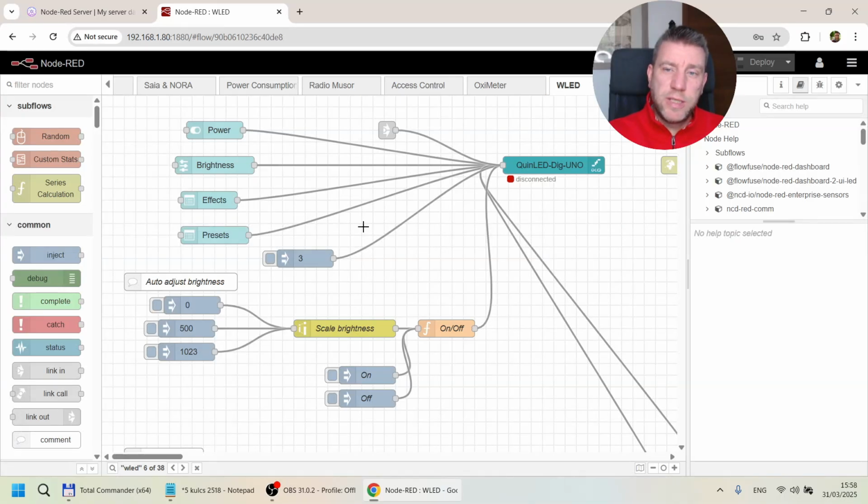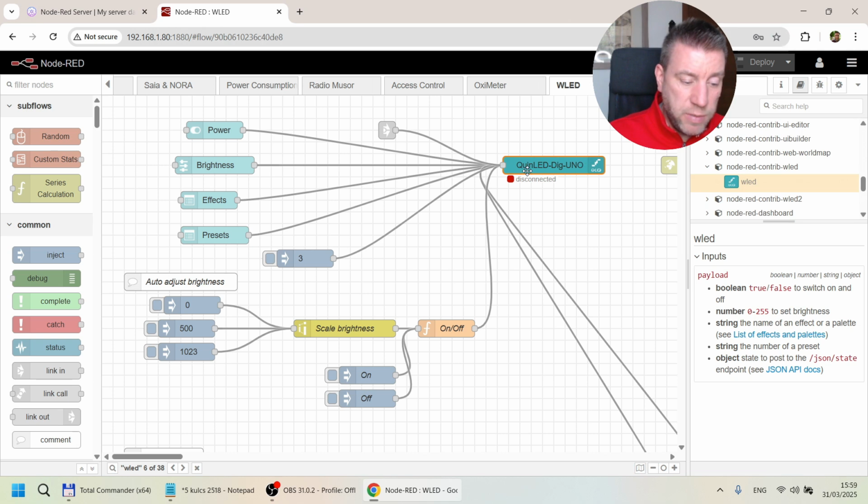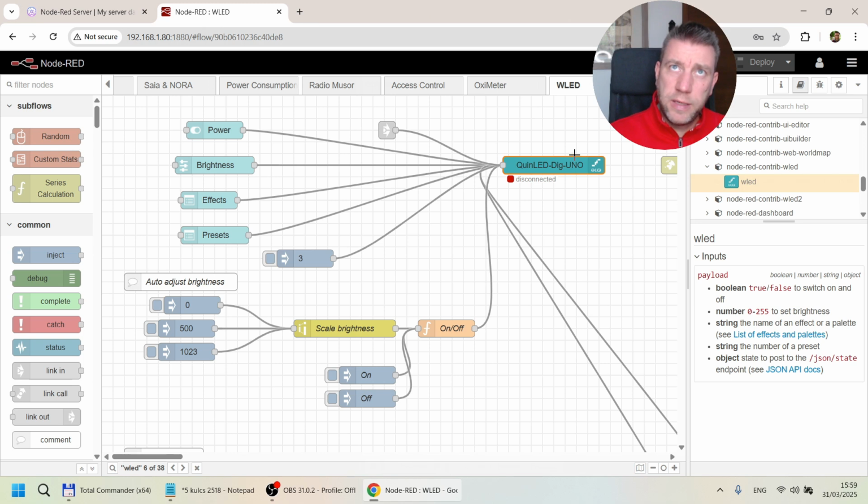And finally, let me show you this WLED integration that I did with Node-RED, and how the sofa button sends these HTTP requests to Node-RED. So here I am controlling an LED strip, which is driven by an ESP, and that ESP runs this specific WLED firmware, which is a very common firmware for controlling LED lights. And it has a particular integration built into Node-RED as well, where I can control basically any aspect of the light. And it looks like it's WLED.